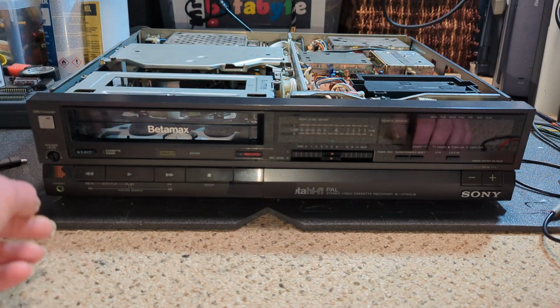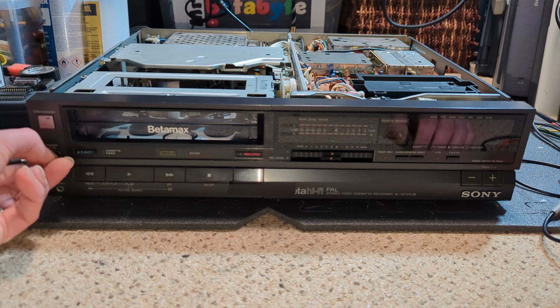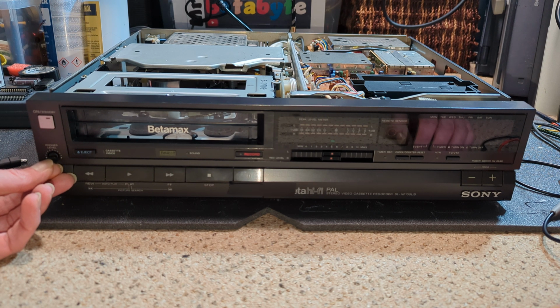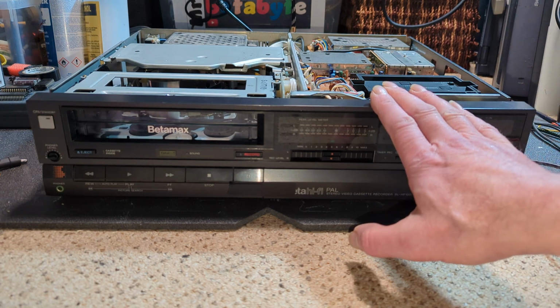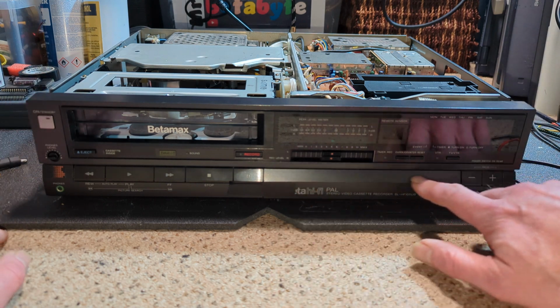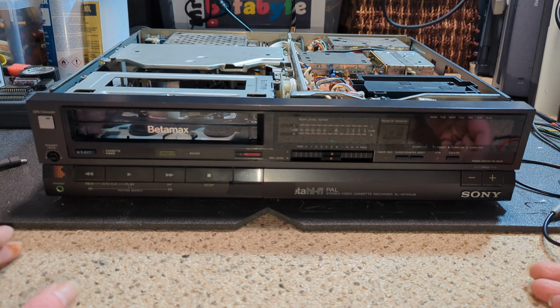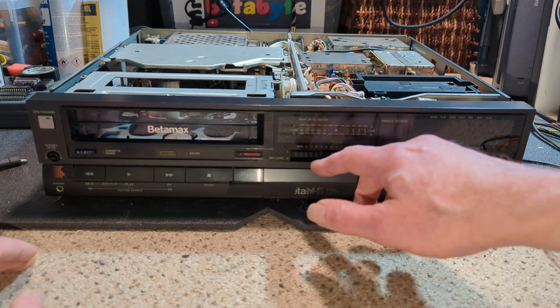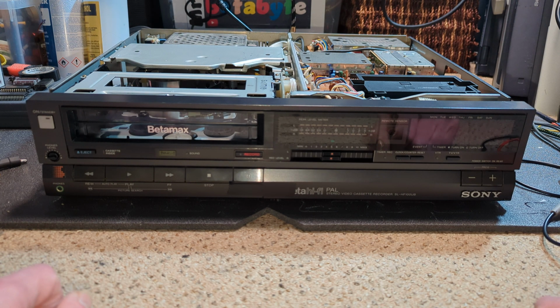I've cleaned all underneath, dusted out, made sure, obviously, putting it back on. When you take this off, make sure that you catch the volume control knob, and then once this is off, just make sure it's turned down, and that the little pointer groove is actually pointing in the right direction. So yeah, turn it down and point it that way. And with the front cover as well, just make sure that all the switches on the actual panel are all pushed down. So when you put this on, all the plastics for the switches sink down with gravity when you put this on the right way round, and you won't damage them. Very commonly I see the switches underneath, the back of them all broken and cracked because somebody's pushed it so hard, it's cracked all the plastics. Generally they still work, but it's not great. So yeah, let's give it a try.